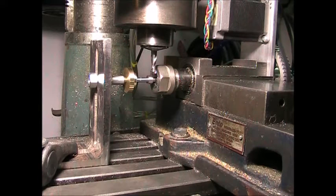When I loosen it from the chuck it's probably going to get misaligned a little bit, so I'll have to use that index point to get it back. I'll also have to move that makeshift tailstock out to let more of the camshaft out as I get ready to turn it. I've got a G-code program written in Mach and loaded in Mach 3 that will cut this profile, so let me go ahead and start this thing up.